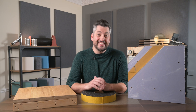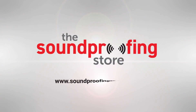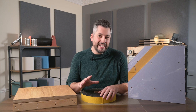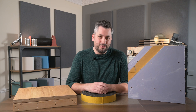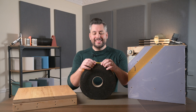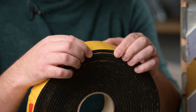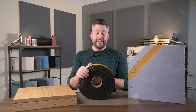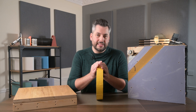Hi, I'm Phil at the Soundproofing Store, and today we're talking about the ProSound Isolation Strip. The Isolation Strip is a 5mm thick rubber crumb material — basically made from recycled rubber tyres. It comes on a 10m long roll, is self-adhesive for simple installation, and comes in three different widths: 50mm, 75mm, and 100mm for different applications.